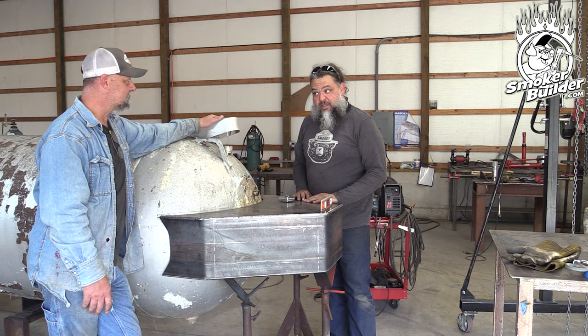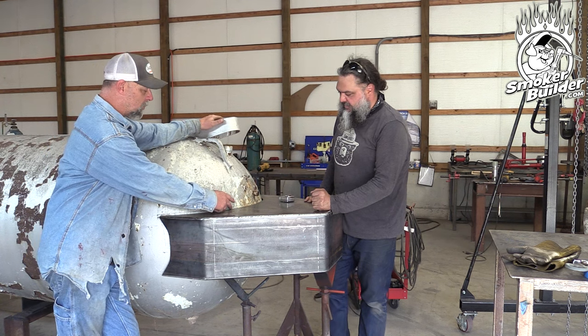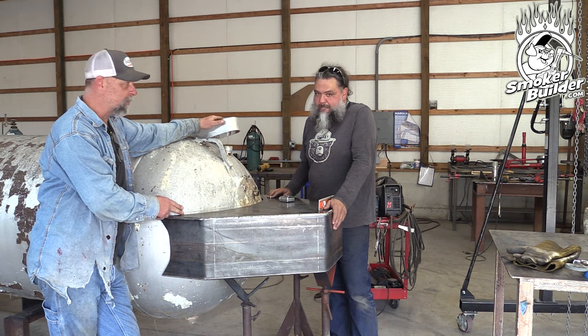There's a whole other thing — who cares about stacking dimes. Did the weld penetrate? That's really what the real matter of the conversation is. If you have a gap there, you're pretty much guaranteed to get good penetration and you're not going to have a cracked weld or a leak. Within reason. I've seen some guys on a thing like this, if they've got a wider gap, they'll put round bar in there and fill it in — run two passes side by side that lap like a root and then two passes.